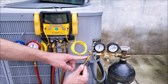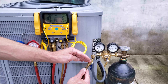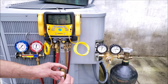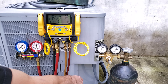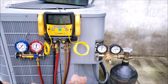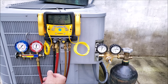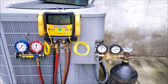When releasing nitrogen pressure from one side with say 350 PSI flowing from one side to the other, you may not need the oil blowout procedure for an existing system. But if you do perform the oil blowout, connect your yellow service line to the nitrogen regulator, disconnect the blue hose at the port, and place a cup there in case a droplet or two of oil comes out. Connect your yellow service line to the red liquid line and flow nitrogen through for about 10 seconds — not to blow oil out of the system, but just to push it to the inner walls of the tubing to prepare for your vacuum.